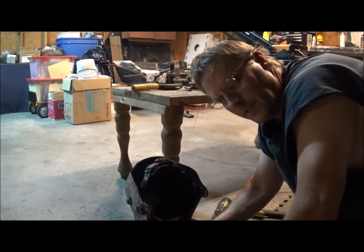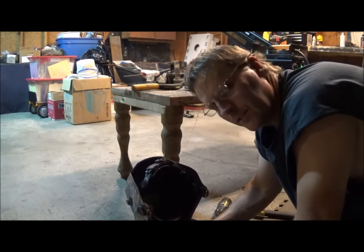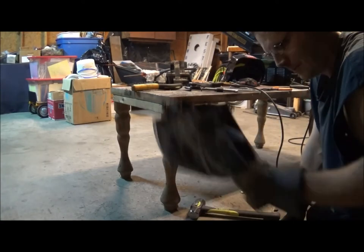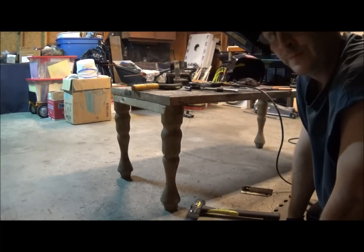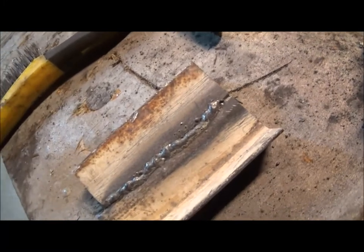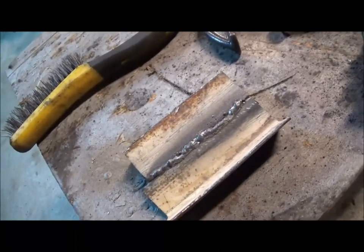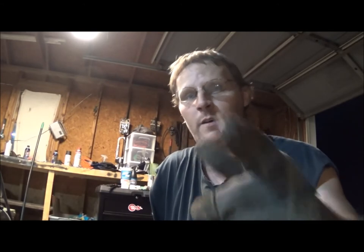If it's in a surface spot it's easier to smooth out, but if it's in a hidden spot, as long as it's welded together good with good penetration — that's a four-pound sledge we just hit that with. I did bend the metal but that's probably because it's hot. Horizontal butt weld and it don't look too bad — pretty decent, and it handled the four-pound sledge. That's a testimony to that flux core Chicago Electric welder. Thanks for watching, feel free to subscribe, and have a spectacular day or night — peace out.